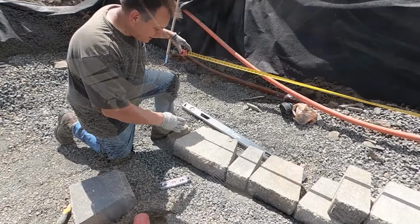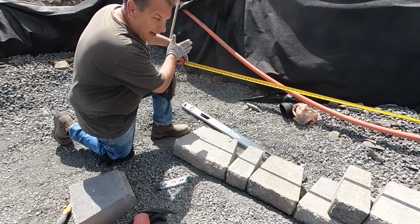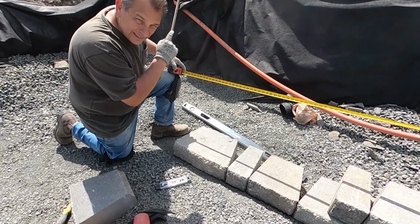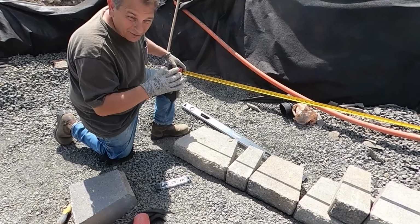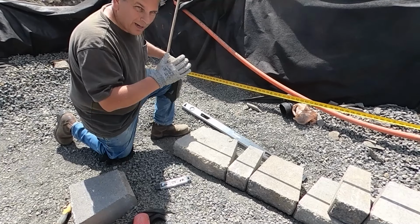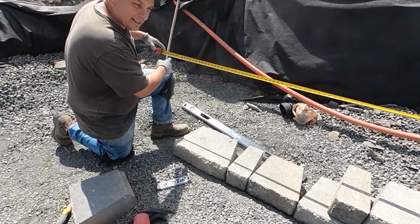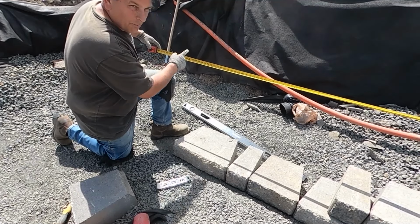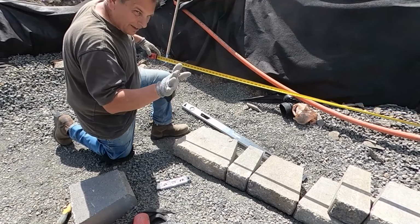Okay, so at 16 feet 10 inches, that is the back of my brick, because it's going to go up and lose 8 inches on the way back, plus half of a brick inside of the post, which I'm not explaining fully, but bottom line is the post is in the middle of our pavers. So that's half of a brick, that's 6 inches. So I need to have 14 inches to come back. 14 inches comes back off of 18. 18 feet minus a foot and 2 inches is 16 feet 10 inches. I think I've explained it now.